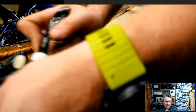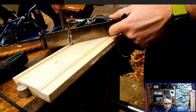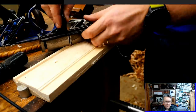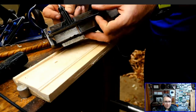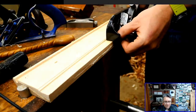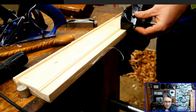If you're the type of person who likes to do full setups, you can put a fence on there. You have to loosen this up — it comes with a rod. Screw that rod on all the way down, and then you have the fence that can slide down, and you can set that to whatever measurement you want. Now that that's on there, it's a question of how to hold it. You're always pushing it up against the fence — you want to make sure the work is all the way up against that fence so the fence is riding on the side.